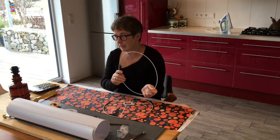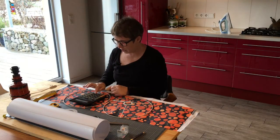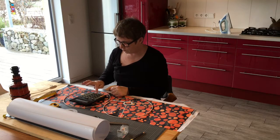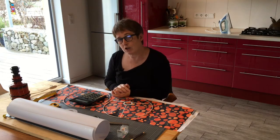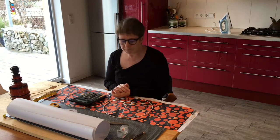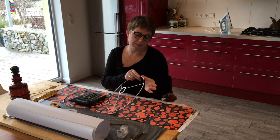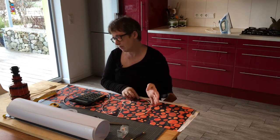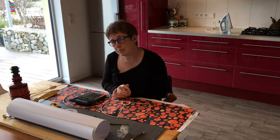My radius was 15 centimetres. So I've got 2 times pi — that's 2 times 3.14 — times the radius 15. We need 94.2 centimetres, plus I need an overlap. The material overlaps on the seam by about 2.5 centimetres, so I'm going to add that on as well. That gives us 96.7 — we're going to call it 97 centimetres.